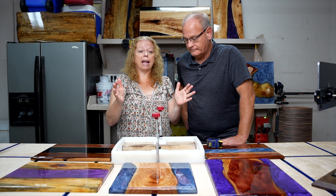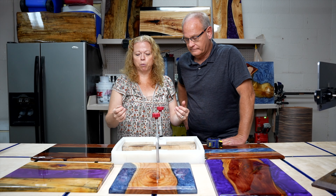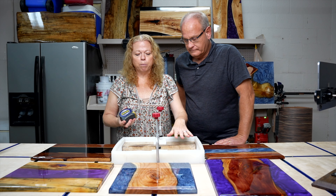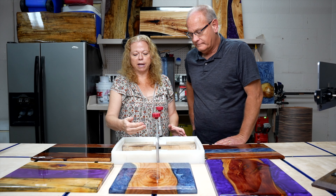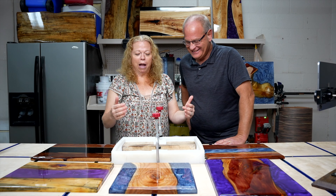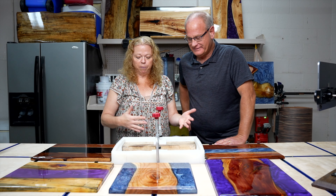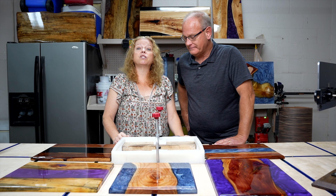Sometimes when doing live edge, the width might go from five or six inches to twelve or thirteen inches, so taking an average becomes more important. The other measure you need is the height — on this particular board we've already measured it and it is roughly three-quarters of an inch thick. We're going to pour to the top of this board and then plane it later to remove the excess. For typical woodworkers, it's actually thickness, not height. To calculate this, you find it like a cube: length times width times height — so for us it's 16 inches by 4 inches by three-quarters depth, which is 48 cubic inches.